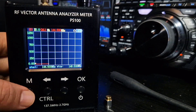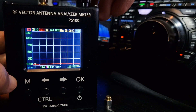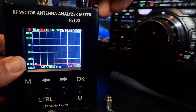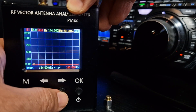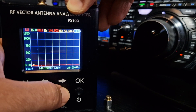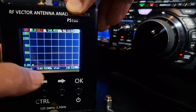So push the memory button — you've got the nice SWR there. If we go right and left, it highlights in red. Then you push the top button and make changes by turning the top large knob, then push across to the next. When you're OK with that, click OK. Then push the right arrow and do the same again. I noticed when it's red you can go up to the top — it looks like there are items that could be changed, and that actually says 'mark.' The items we're interested in are the bottom two — megahertz and ohms. We've gone from 144.500 to 146.530, spanning across those bands.